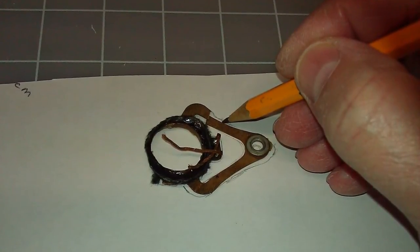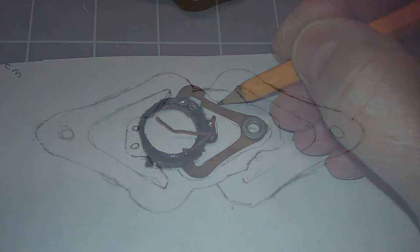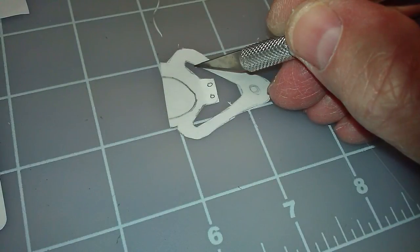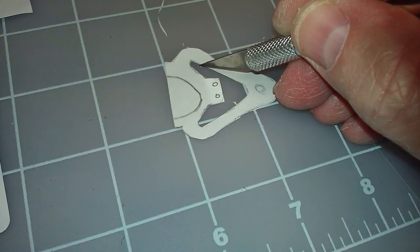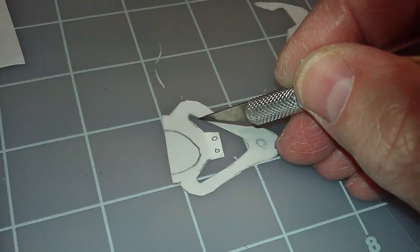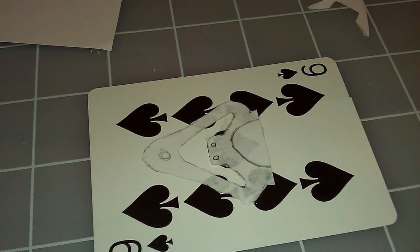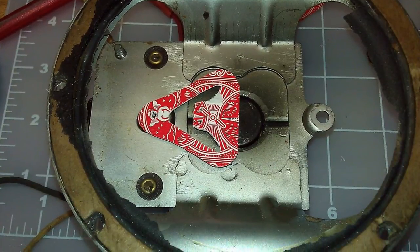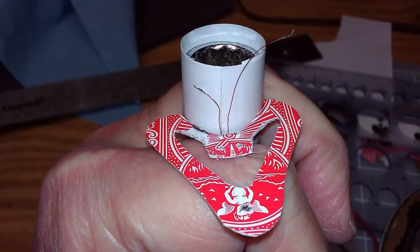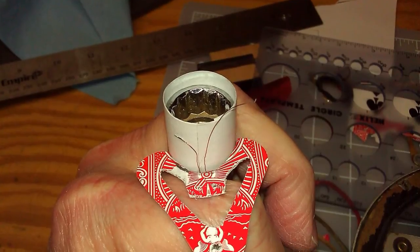With the voice coil complete, other than cutting to the desired length, I focused on recreating the spider based on the partial spider that was remaining. Here are some photos of me tracing out the existing spider, cutting it out of paper, and confirming its compatibility and match with the voice coil and associated speaker frame. Next, I used a spray adhesive applied to the back of the spider I had just cut out, let it sit for about 30 seconds, and applied it to a playing card — which is what I decided to use as my spider material due to its composition and flexibility. Some additional photos here, just me checking the spider for proper fit and size, and doing some trimming to support the attached voice coil former.